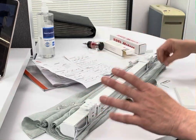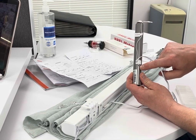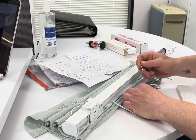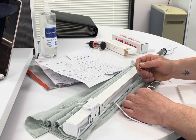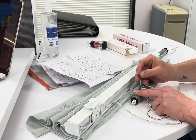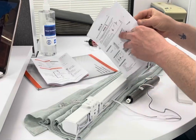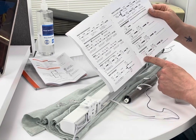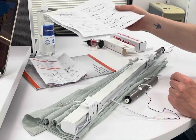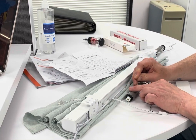I'm going to start by completely resetting the memory on the motor. You do that by hitting the reset button, also called the P1 button, right where the cables come out of the motor. I've got the motor plugged into a source so the computer can output the information. I'd like to use just a paper clip — anything that works. Do not push down too hard, just a light push. To do a factory reset, you hold down P1 for 14 seconds until you get four jogs of the motor.